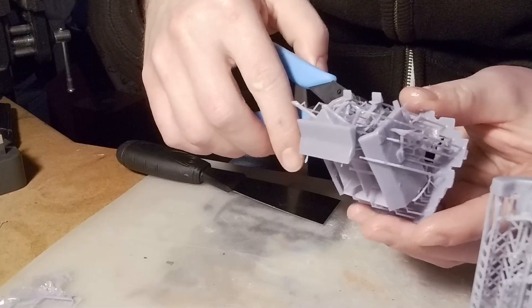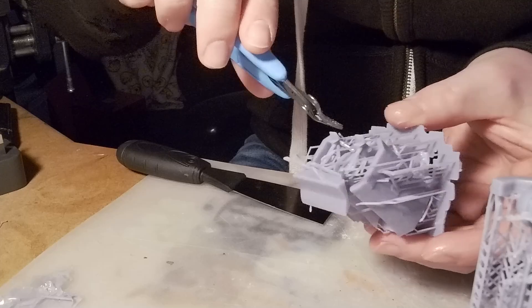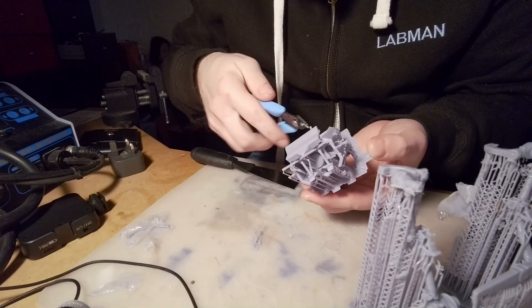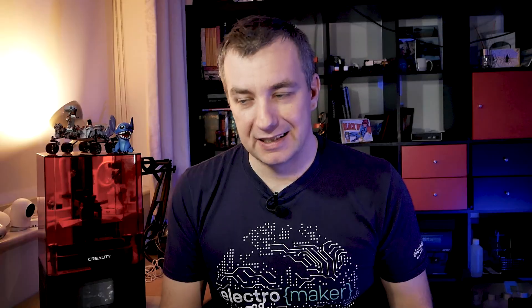Both the vat and the print have to be washed with IPA alcohol, which is messy. I started doing it in a sink and quickly gave up because resin is difficult to wash off surfaces, especially when it gets cured by UV from sunlight — this is something that will get you in trouble with your partner. When the print is washed, you can separate it from the build surface and remove supports carefully, because brittle fragments of resin will fly all over the room when using clippers, so expect another half hour of cleanup.